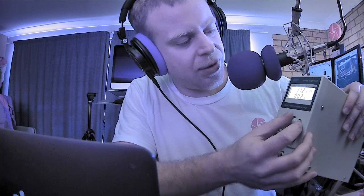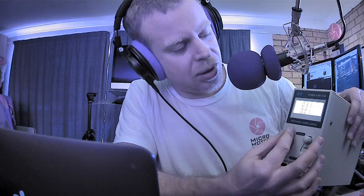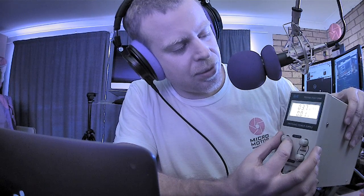There's a fine and a coarse knob and you can set it to whatever voltage you need. I'll set this now to 3.5 volts. You have a coarse knob to get it sort of in range and then there's a fine one for fine adjustments. I'm setting it to 3.5 volts and turning up the current all the way, so it's not limiting the current. You can see here it says CV which stands for constant voltage — it maintains the voltage and provides as many amps as required, up to 5 amps. This thing does a maximum of 30 volts.